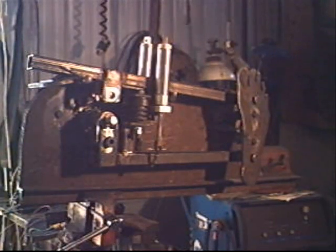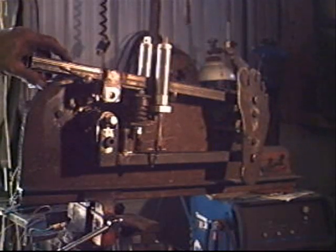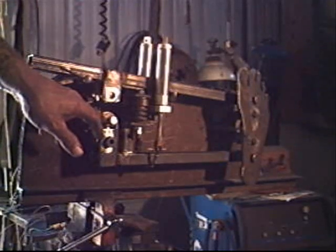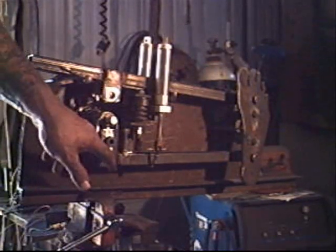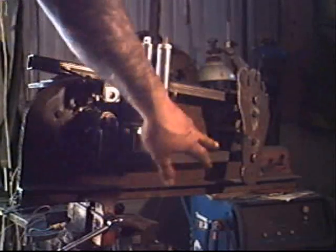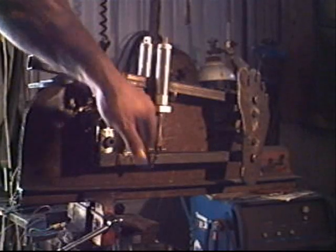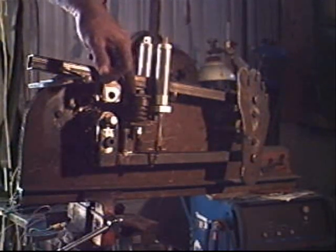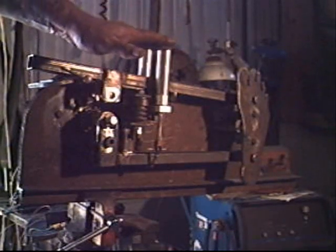This is my new variable force planishing machine — a reciprocating machine. It has a cam tied in through a connecting rod to a lower arm which cycles up and down. There's a pad on the lower arm, not connected to the top arm, that knocks the upper arm upwards.